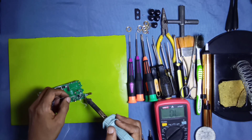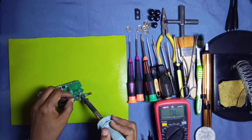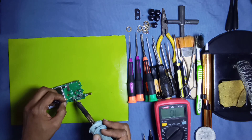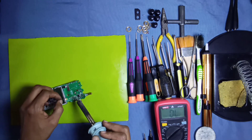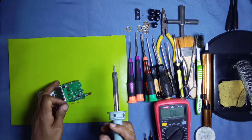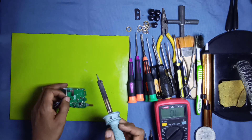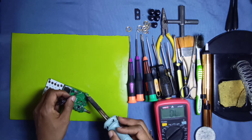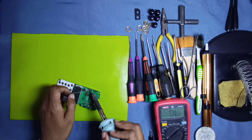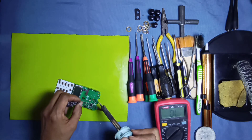One thing to keep in mind: when you fix this volume switch, check the legs properly to ensure they are installed correctly. Solder all the points carefully because there are many small points very close to these switch points, so take a little bit of care. Now check all for dry solder — if there is any dry solder, solder all those points.